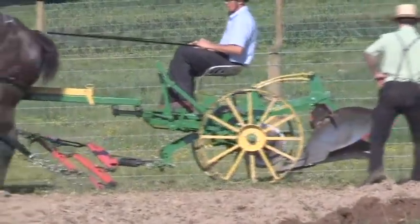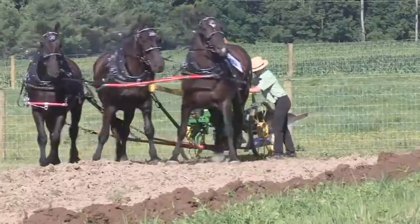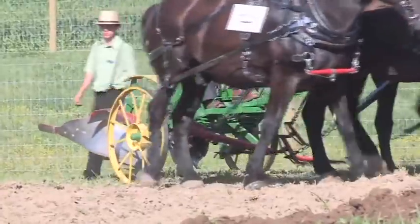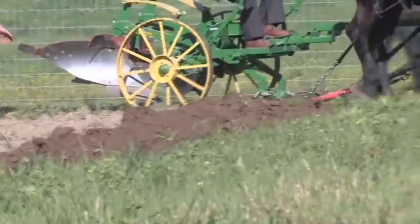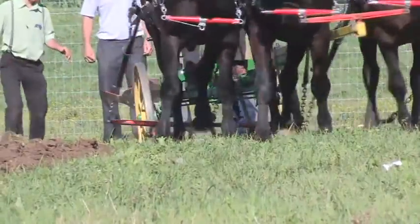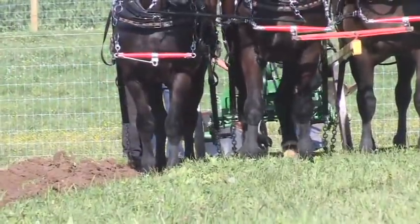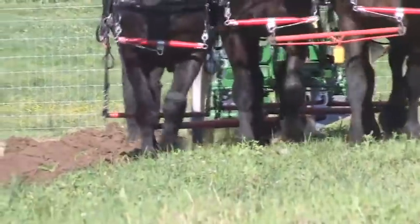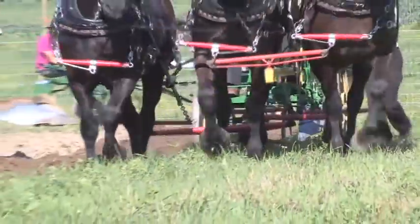This is a two-way plow, also called a hillside plow. Two-way means you can plow the same furrow in either direction — this eliminates all dead furrows in the center. That, plus a unique side-leveling system, makes it a must on a hillside or narrow strip tilling between other crops, rows of plastic, and so forth. This plow is well-balanced with all-purpose Keystone series plow bottoms designed for slower speed, animal draft power. The two-way plows you see nowadays are sitting in folks' sheds — they're collectors, some more or less worn out. But the concept still remains; you can borrow that concept.